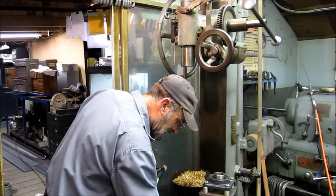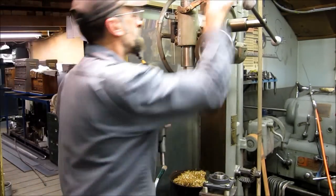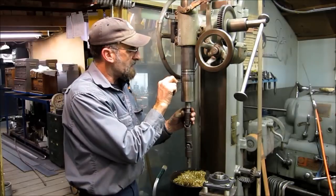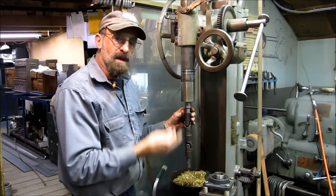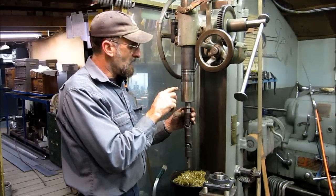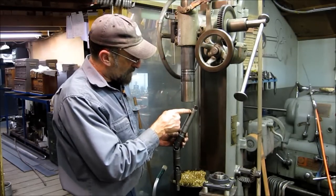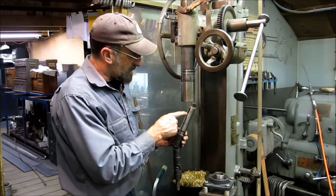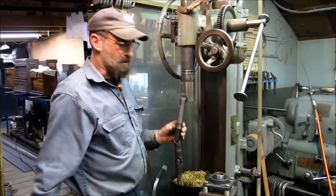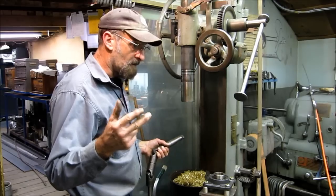I did incorporate a small hole at the top of the Morse taper. With the drift hole here, when it goes in, I was able to put a roll pin right in there as a safety so it doesn't come out. This is typical on a horizontal boring machine — you had a knockout key and a holding key, and they worked opposite, with two holes. This hole had one pin that went in and forced it up, and the other one released it after you knocked that back out. The horizontal boring machine is one of my favorite machines of all time to run.